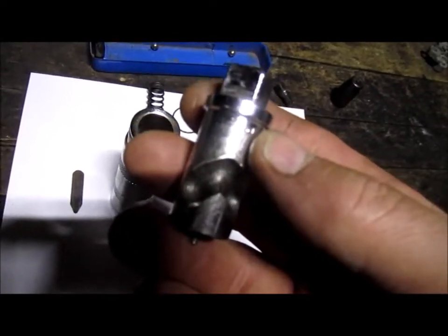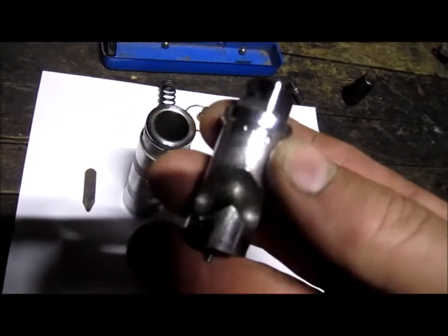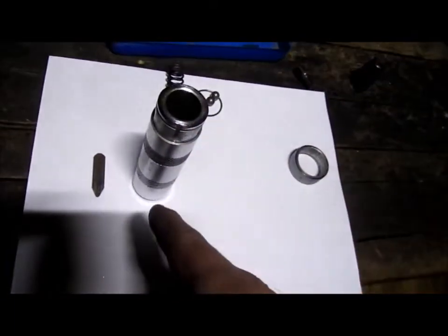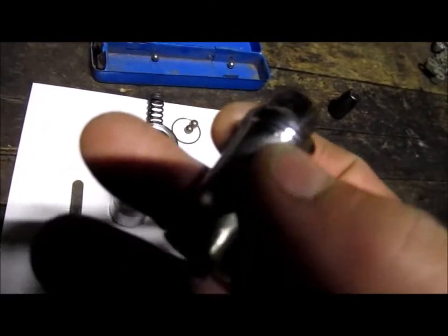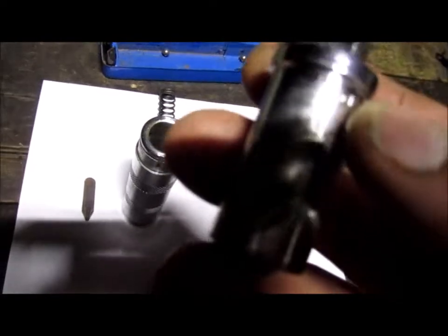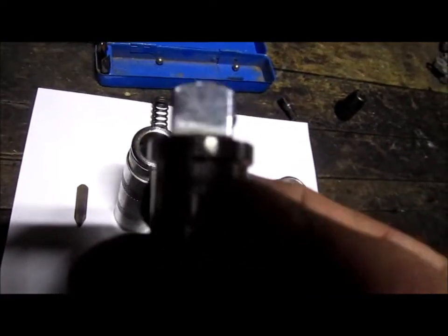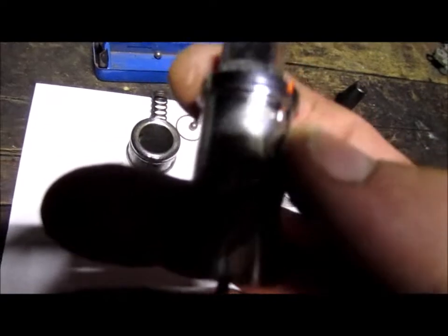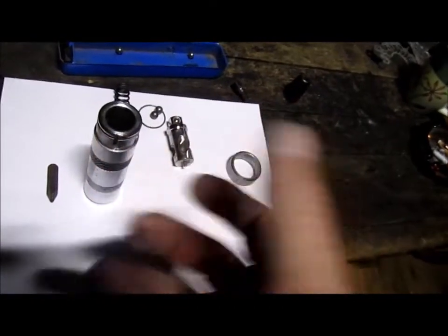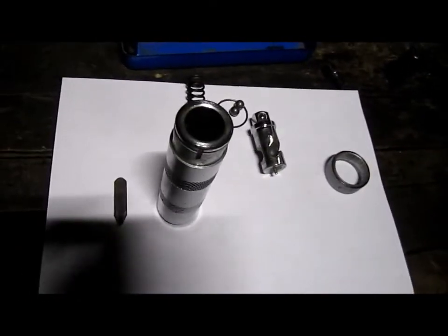It's meant for tightening or loosening — it just gives a little turn. The idea is to hand tighten as much as you can, and if you need more than your hand can produce, this is where the tool comes in handy. You set it in place and whack the other end with a hammer and it will tighten further. The same works in reverse for loosening — whack it and it loosens just enough to free it so you can use your hand the rest of the way.